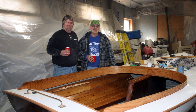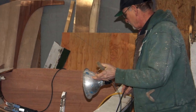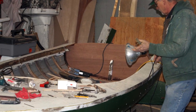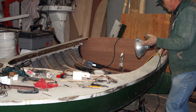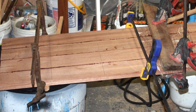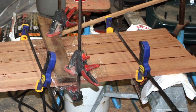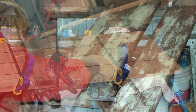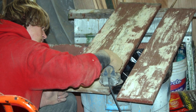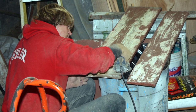When I say 'we,' I'm talking about John Taylor who runs Tooker's Boatyard down here. John and I measured each one of these ribs. We cut up oak, probably one by one, took a long four-inch copper tube, capped one end, filled it partially with water, put a burner to it, dipped the ribs in a couple at a time, steamed them, then took them out and bent them and put them in place. It was mostly cedar and oak in the entire boat.